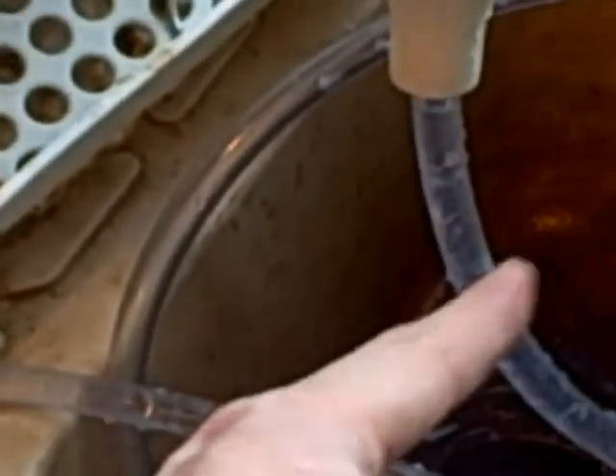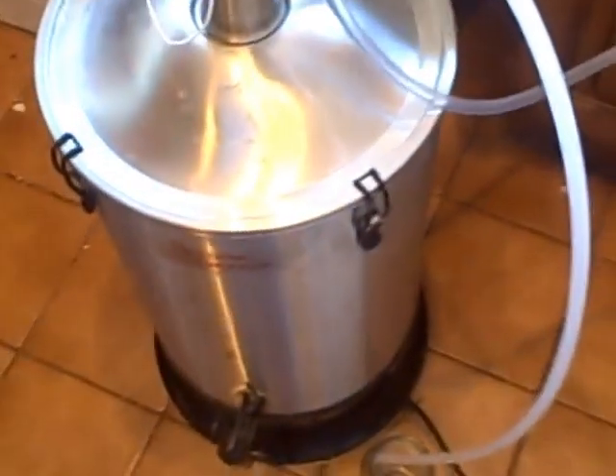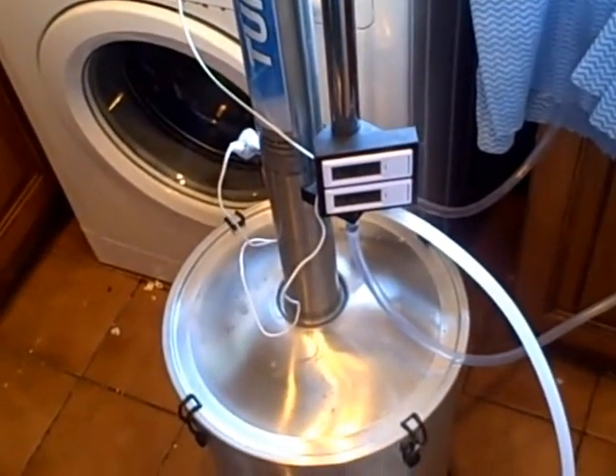I don't have the prerequisite screw-top tap so I've had to use one of these, which is very difficult to get right without water pouring everywhere. Either way it seems okay. This is the water inlet to the distiller; the water outlet is there. We've got water flow already lowering the temperature - the top thermometer reads 18.9°C and the bottom one is 14.5°C. I need to monitor the water flow and keep the bottom temperature between 50 and 60 degrees, ideally about 55.